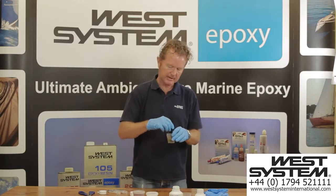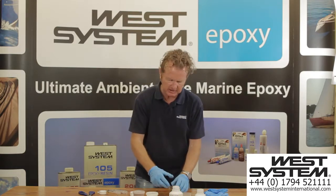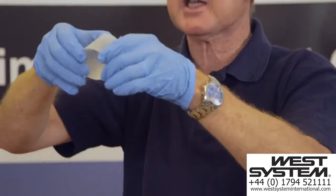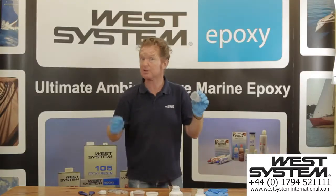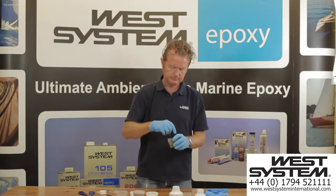Make sure that whilst you're mixing, you mix right into the corners of the mixing pot. It's very important that the next day, when your mixed epoxy has cured, that you roll the pot and break out the waste. And if you see a small residue of uncured resin and hardener mix in the bottom of the pot, you're not mixing sufficiently. Very good check on your own work. Bit of quality control.